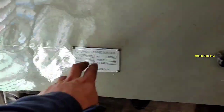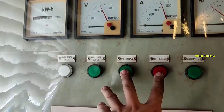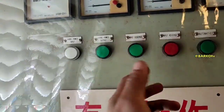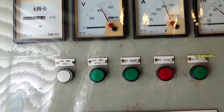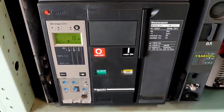During dry dock this is very important — the shore connection box. You must check that the phase sequence is correct. If it is not correct, interchange line 1 to line 2, or line 2 to line 3, until it is correct. Then you source in through the shore connection box.